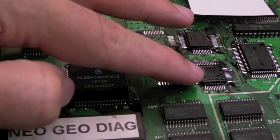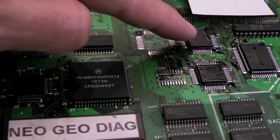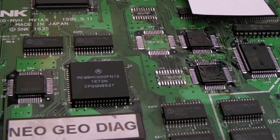Back over to the one with the BRAM and the 5 Neo buffs, you can see I started to put some of the other chips from the other boards on here. That one there, it goes straight into the sound test, so it's holding D down, so that's faulty. This one here, select and start, does work. I can actually press select and start to reset. Now obviously I've not tested player 2, but I now need to swap this one out again. This is the problem. On every one of these boards there's been a minimum of 3 on average Neo buff faults, maybe even 4, because I've got three boards here with hardly any buff chips left on them at all.